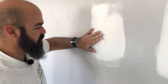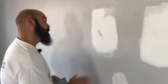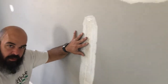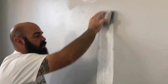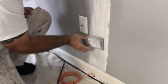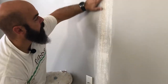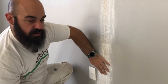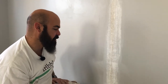That's not too bad, but there's still a little bit of a raised edge here, so I think we're going to go ahead and do another light skim and that should take care of it. This area is where we had that wire harness — we just did a light skim after we removed the glue. It was a very, very small raised edge so it didn't take a whole lot to fill that in. I always like to run my hand over a patch after sanding because you can feel those little edges that will show up once it gets painted. That feels pretty good so I think we're good with that one.